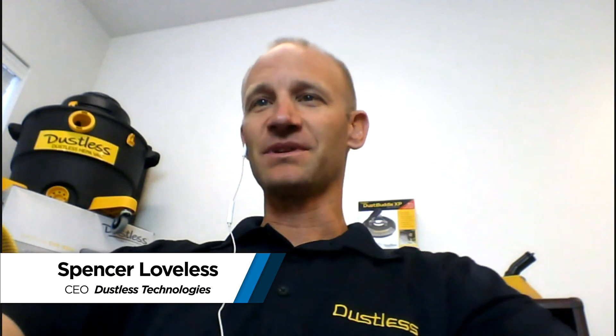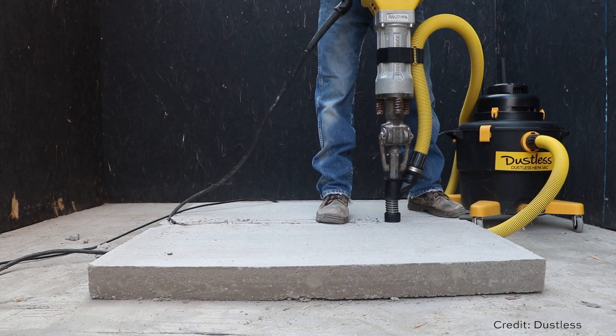Dustless is a family company. We've been around for 40 years. My dad invented a vacuum for ash out of wood stoves. That evolved to a wet-dry vacuum, which evolved to different dust collection attachments for tools — attachments for jackhammers, grinders, skill saws, reciprocating saws, and all types of different products, all based in the U.S. Most of our products are made through injection molding. Injection molding has been around for 100 years and is very tried and proven. But the drawback we see is the agility to go to market quickly — almost every single time we cut steel and start producing a product, we always wish there was something we could change. So we're trying to get away from being stuck to a hard tool and be very agile to meet our customers' needs.